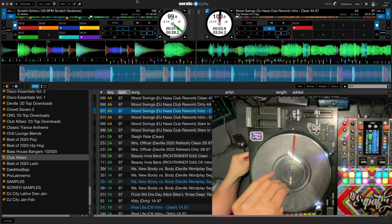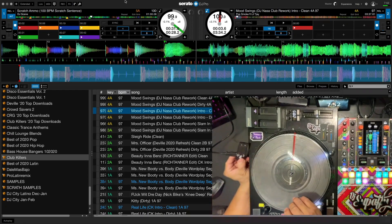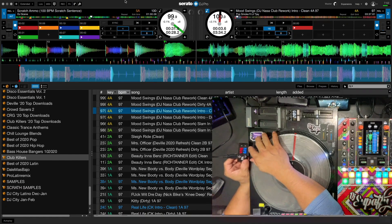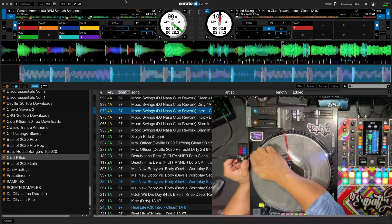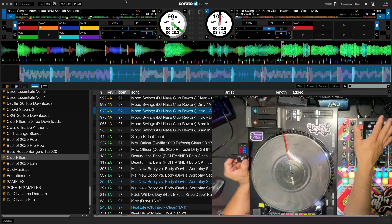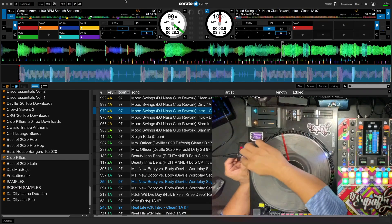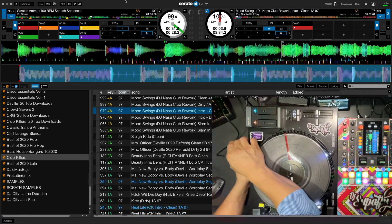You can interlink the Reloop turntables. The voltage is still about 4.7V and the amps needed to run the base is still pretty low. But if I add the remotes, you'll see that jump up. It needs about 0.60 amps to charge, and if you remember, the mixer was way less than that — almost half of what's needed. You can see both of them are charging now. This is how you can tell if your USB port has the right amount of amps to charge the remotes.